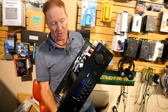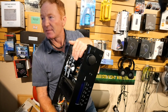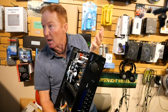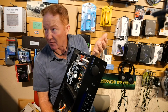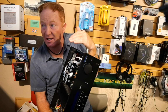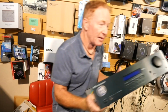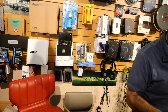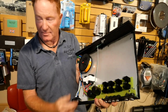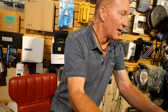So that's an in-between. So we took mid-fi, and this started with 20,000 microfarads, is that right? And we took it to 60, which is more than a Yamaha that would have 6,000 or 8,000 microfarads a side, or 12 to 18,000 total. So you keep going up. They're starting to admit that energy is important. Naim Audio, for instance, admitted that they wanted 30,000 more in a flat cap, and we added to 60 because it's the max that it could take.